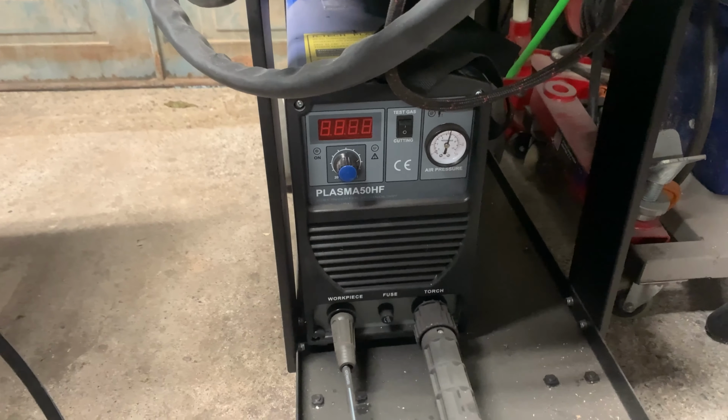Say we got on with a 50mm hole saw through there. Like I say, it's going to be doing a bit of this, but that's all I got, so we'll give it a go and give that a shot. That's a 51mm hole saw through 12mm steel. I've slowed the pillar drill down as low as I can go with it, and we'll see what happens. Like I say, I think you'll find that the plate will be doing this because the arbor's off. At least that's my thought about it. But here we go.